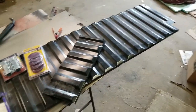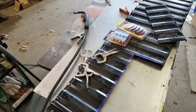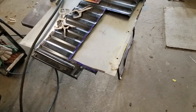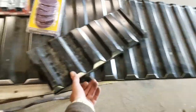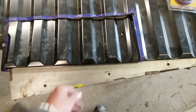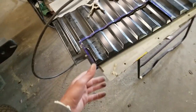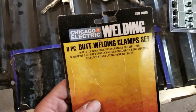Here's how this repair patch came to me — it had this section cut out and I can only imagine they were going to replace it inside the truck, but that's really not the way to do things. We have this piece that's been cut out, and I'm thankful it's been cut out fairly well, because we're about to put that right back in there, weld the patch back into the original panel, and then put it into the truck the right way — or my way, anyway.